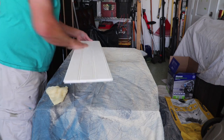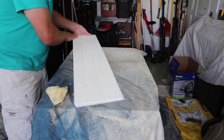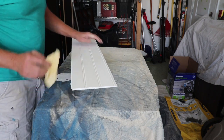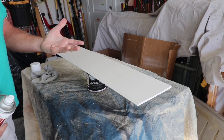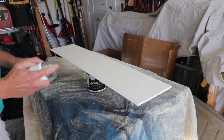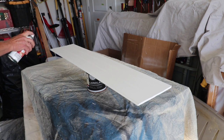I'm going to tack up and make this so smooth that, as my woodshop teacher back in high school said, make it so smooth that a fly can't even land on it. I like to use the shellac primer — it dries quickly, fuses really well with lacquer finishes, and you can go ahead and start putting your top coats on in 15 to 20 minutes or so.